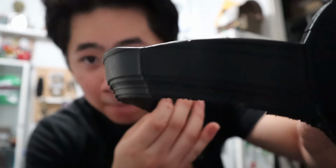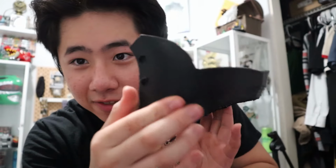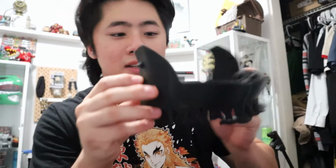Yeah, I didn't scale it correctly to the part, because I guess this is at 100% scale, and my helmet I printed at 108% because it was a little small for me. When I printed the back plate, as you can see, it was a major layer shift in this piece, so I decided to reprint it. And the second time it came out a little bit better, but unfortunately there was still a bit of layer shifting. But either way, I didn't notice this until I realized I didn't scale this up and I didn't want to go through another print time.